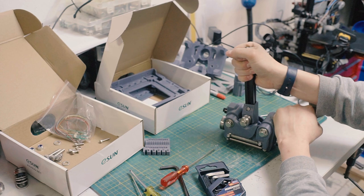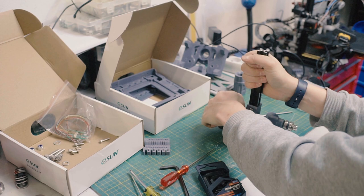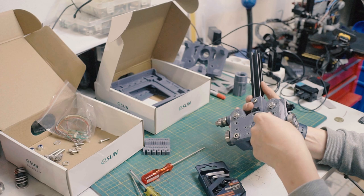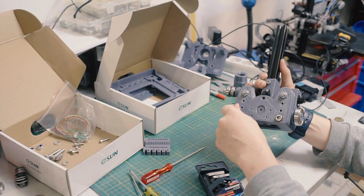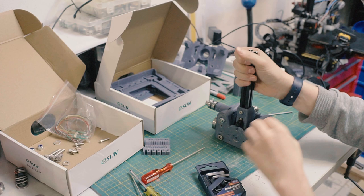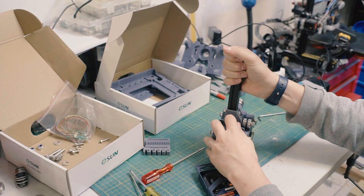Oh yeah. Oh shit. I haven't actually put this together with both springs on it, and it is fierce. We'll find out if the gimbal can take that amount of force. Now that we've gotten these top ones tightened, we can tighten the bottom ones. Probably could have done that before we put the springs on, but just tighten until you start hearing a crack. That means you're starting to crush the infill, so you're probably going too far. There we go. Or just far enough. Yep. And then this guy's nice and stiff.